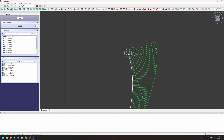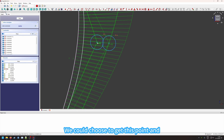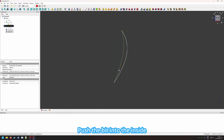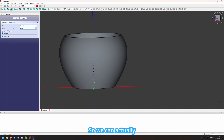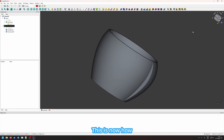We create another b-spline for the outer edge, making it slightly bigger. We set the horizontal distance of these two control points to 1 centimeter. To check if we like the width, we bring back the revolution and do a quick half-revolution to see what we made — this is how much it will stick out.